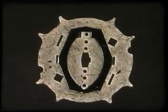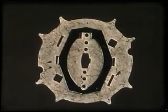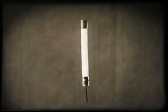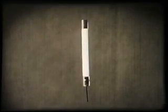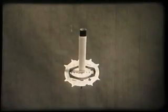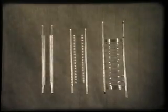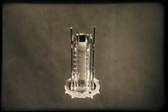This is the bottom mica on which the assembly will be built. Next, the cathode — this radiates electrons when heated. Grids 1, 2, and 3 control the flow of electrons passing from the cathode to the anode.